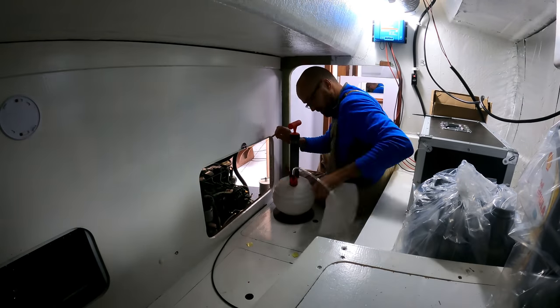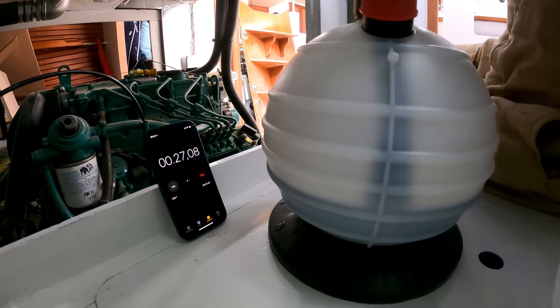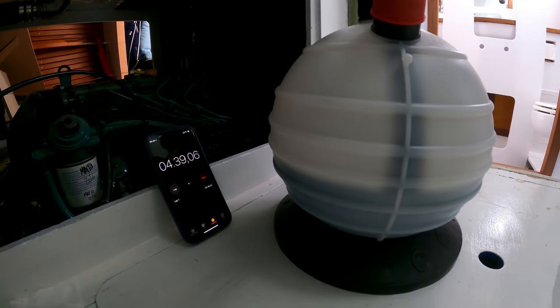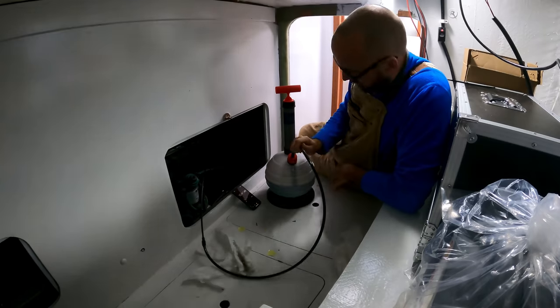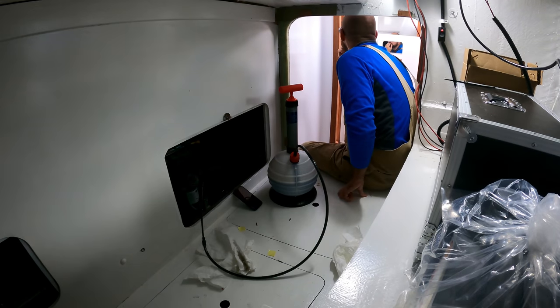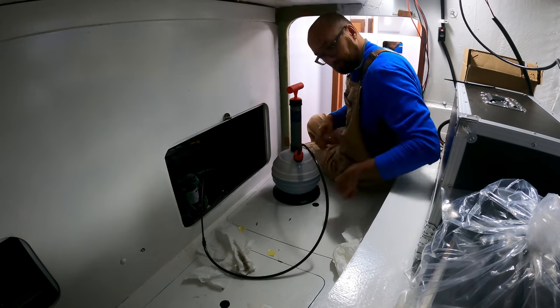A while back, I picked up one of these oil extractor 6000s. It might be fine if you only need to do one oil change a year, but holy guacamole, Batman, this thing doesn't suck. As in, it's horribly slow. It took a lot of pumping and a lot of babysitting to get the 6 liters of oil extracted. I've ordered a 12 volt gear pump to use instead. That'll be easier and a lot faster.